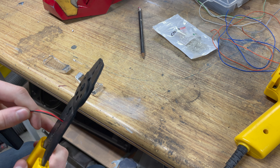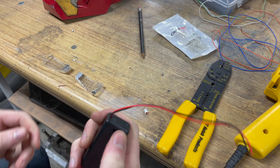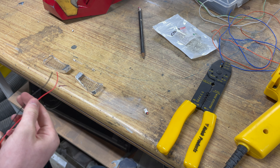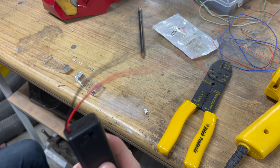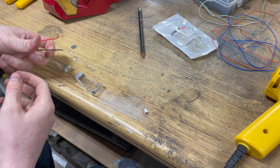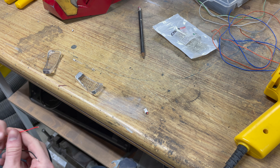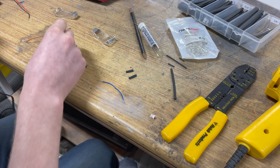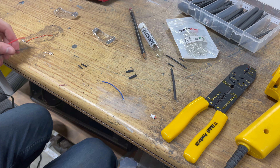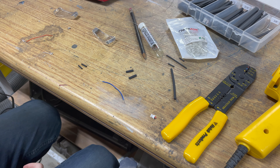It's time for me to design my mini circuit — shouldn't be too difficult. I need to cut off this little connector. I purposely got a battery pack with an on-off switch, so I'll be able to just flick it on and off without having to solder in an extra switch or take the batteries out to turn the lights off. This little mini circuit's going to have to be in parallel because these are 3-volt LEDs and this thing puts out 3 volts — so I need parallel in order to have equal voltage across the elements. Basically, I'll quickly solder the battery to one LED, then two wires going to the second LED, and that way I have a simple parallel circuit. I'll just solder it and show you when I'm done.